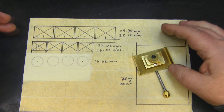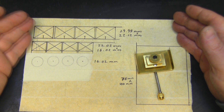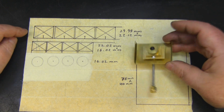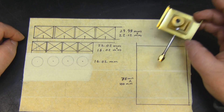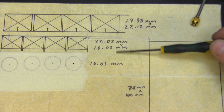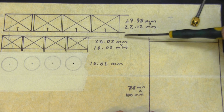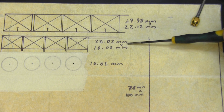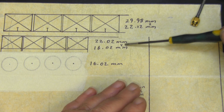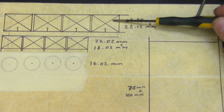I'm going to give you the measurements for this as well — you could quite easily just build that driven element and these two parasitic elements, then make a back reflector and you've got one of these. We're going to make four of these. I've already marked out the elements on this brass sheet — it's 0.5 millimeter brass sheet, really nice. It's strong enough that it's not easily bent but you can still cut it out with a decent heavy pair of scissors.